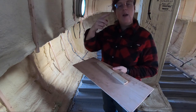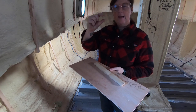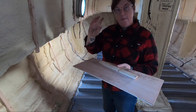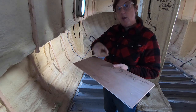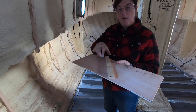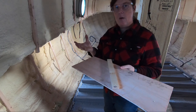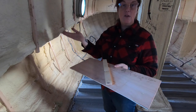And they look like screws, big screws, but they've got a kind of nut on the end, if you like. And so you can put them in with a spanner. So I'm going to fix battens there, and the battens are there because I'm going to use those to screw through this ply and into the batten. So I'm screwing through wood and into wood, and that means that it's going to cut down a little bit on this kind of movement and the squeaking, but also it means that they're much easier to remove.